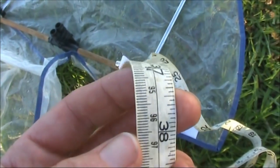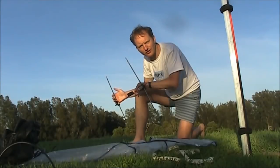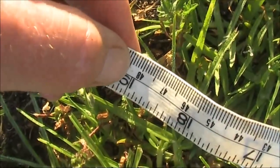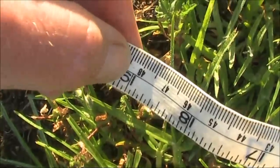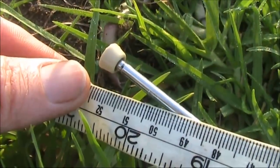It's useful to have a tape measure when you're setting up for the first time, or in case you forget your tape measure, memorize some important dimensions on your body so you can measure antennas out in the field. On 2 meters the driven element is 48 centimeters from the dowel boom and the reflector 52 centimeters.